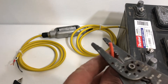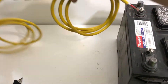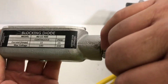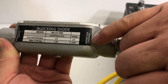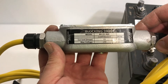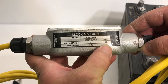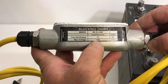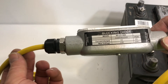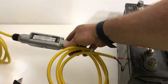The other side goes to the diode output. This diode is marked right here — battery side, or cathode. It's the cathode side of the blocking diode. This one is rated for 15 continuous amps, 25 peak, 100 volts continuous, 200 peak. This is just a 12 volt system, so we don't have to worry about that. This other side goes to the generators you're going to connect to, or a solar panel.